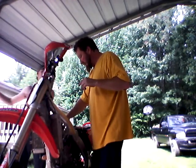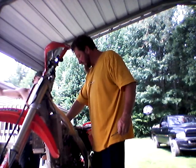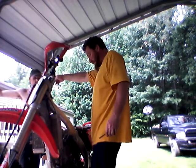What did I say this other side was, Billy? I'm trying to concentrate here now. No, this wasn't 4. This side was the side that was out big. This side here, we need to go 4 thousandths difference on the right hand side. We can't be any higher than 4 thousandths. It's got to be from 4 thousandths to 2 3/4 thousandths smaller to put us in the range.